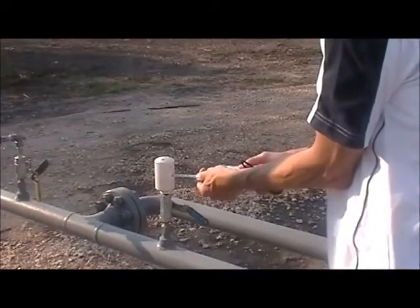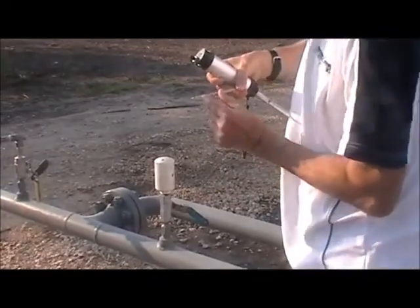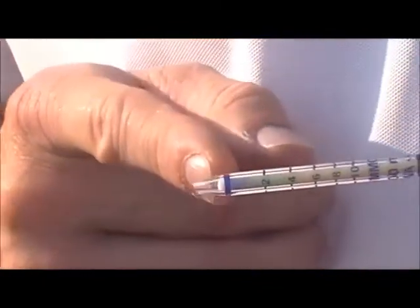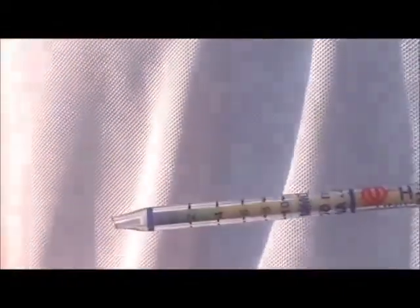Remove the tube from the pump and quickly make the reading. Here we have four pounds per mmcf. You can see the reading is still four pounds per mmcf, but quickly the ambient air is intruding and causing a purple color interference. So you need to read the tubes immediately.